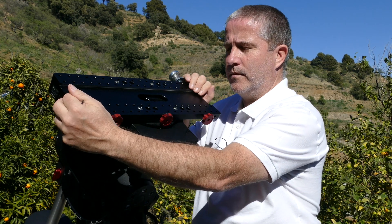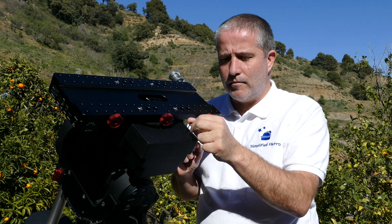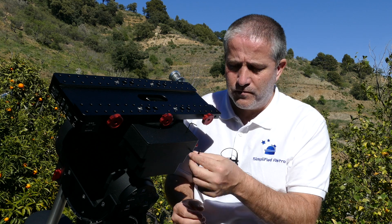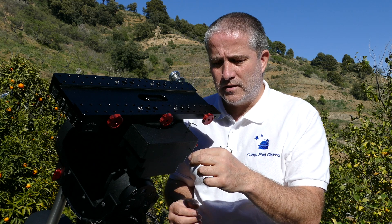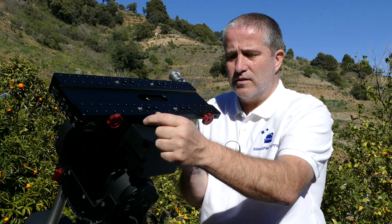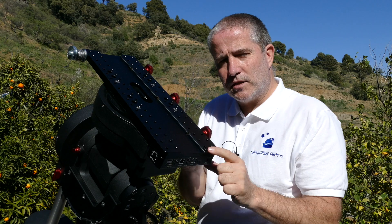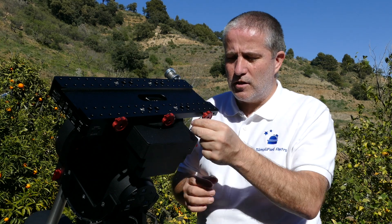You can still hear that movement, so what we're looking to do is just get rid of that. I'm going to undo the grub screw just a quarter of a turn, then put the 3mm allen key in the front screw and turn it just the slightest amount — a sixteenth of a turn clockwise — then lock off the grub screw and try it. I can bring my gear back and there's still the tiniest bit of movement, so I'll do the same again.